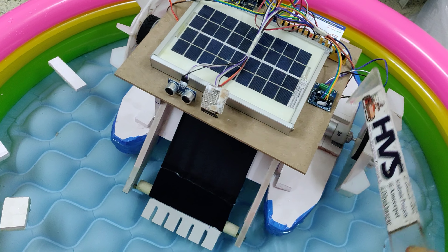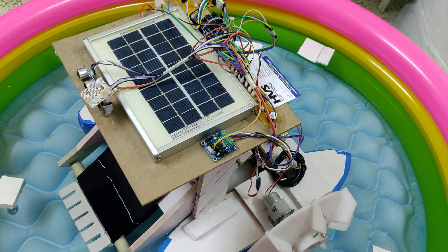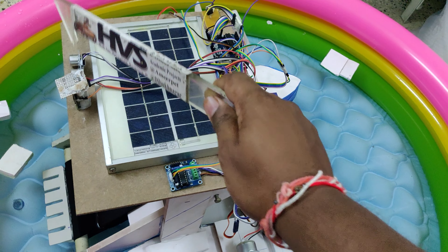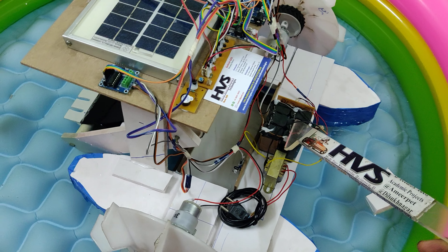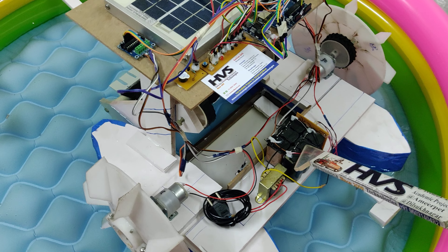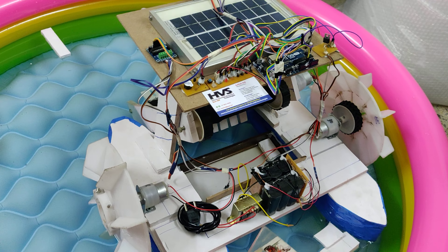At the same time we can get audible alerts from the buzzer. We have placed a piezo buzzer here which is 5-volt operated. These two outputs activate whenever the trash bin gets filled. The whole system gets power supply from a 12-volt 2-amp rechargeable battery pack.